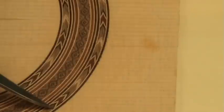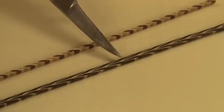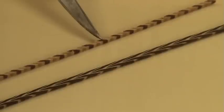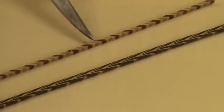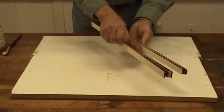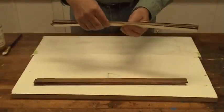There's also a rope pattern and a wheat pattern that we can make, and they're all made in basically the same way. This pattern here is a herringbone — it consists of a dark veneer alternating with a white veneer. Here we have a rope type pattern; it's got actually four different colors of veneer: purple heart, and then two different light color woods, maple and cherry. What I have here are two identical stacks of veneer organized in the correct sequence: white, three darks, white, three darks, and so forth. Each of them has four repeats, so I've got a total of 16 pieces of veneer.